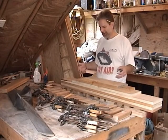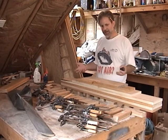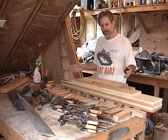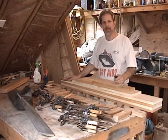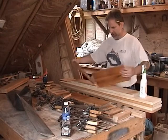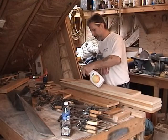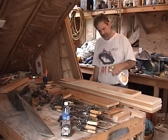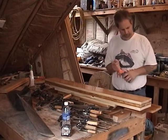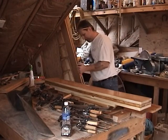Blocking is underneath. I've got my blocks and clamps lined up. My next step is I'll wet all the surfaces of the wood down. I use a polyurethane glue — soak and saturate everything. This glue works really well with saturated wet wood; more humid is better. I use Elmer's polyurethane — this is the best stuff in the world. It bonds really well, expands when it dries, and holds better in water than any other glue I've ever used.